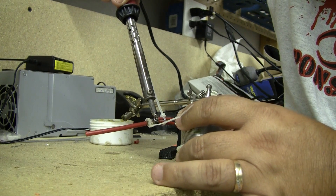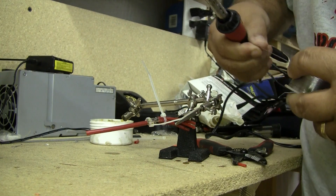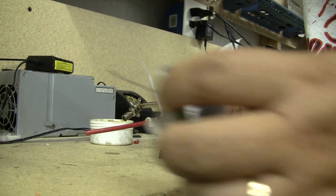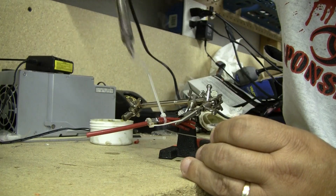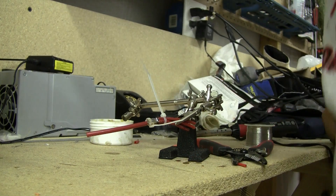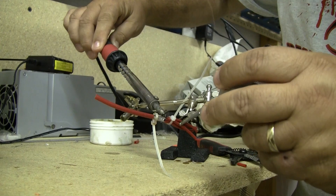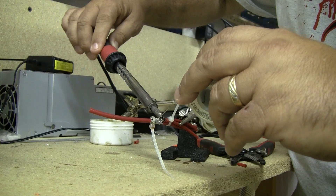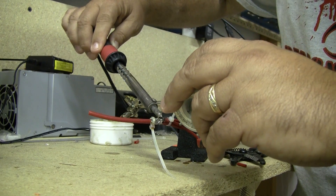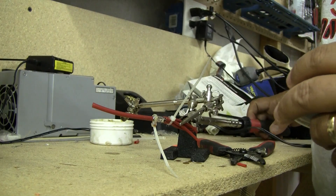You can see I'm really putting a lot of solder in there — you should see it eventually come up and start filling in the gap around those wires. I'll let it cool, then turn it around and keep going around that wire, filling in all those gaps. Plenty of heat — I'm not even touching the iron at that point, just letting that solder wick right down in there, making sure it's getting into that center power cord.